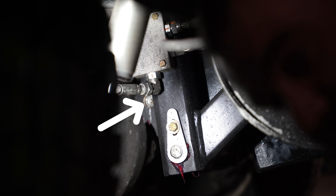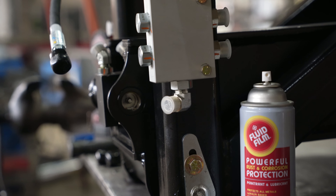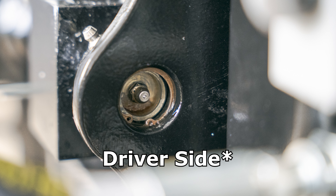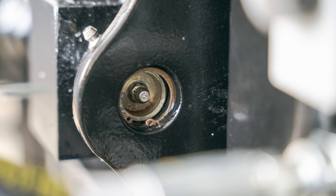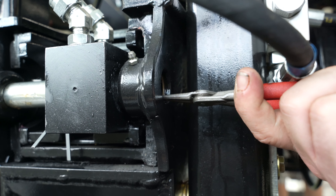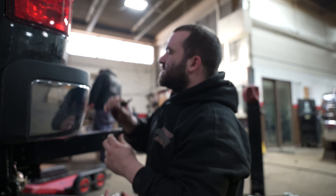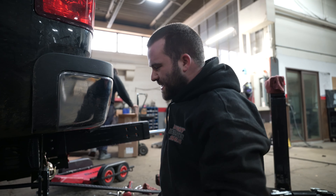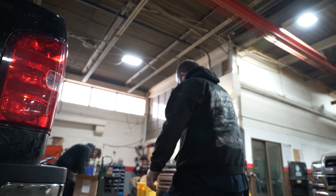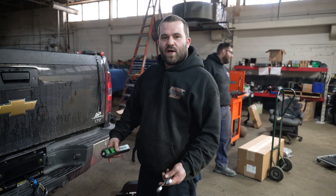So now we're going to work on the back stinger pin and take off the lines that go into the back of the cylinder for the in and out function. First things first, I come to this side to take the snap ring out. Once I take this snap ring out, I'm going to go to the other side so we can do the rest from there. Before you go under there, you want to make sure you've got everything you'll need to take the lines off and knock the pin out.